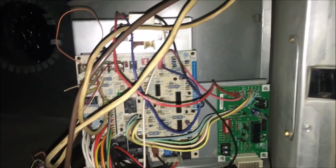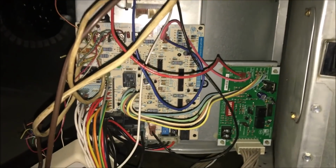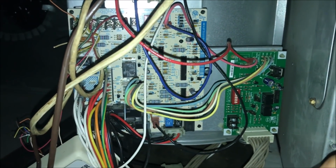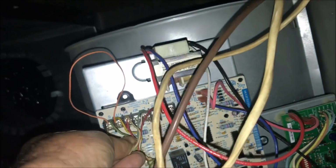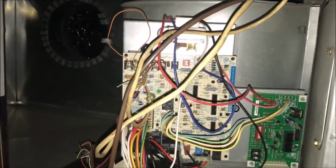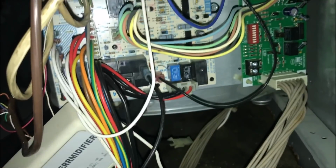But I smell something. As soon as I open this up, I could smell something burnt. I don't know if it's fan motor, transformer, or what it is. We're not getting any power. And the fuse is not blown. Like one screw missing, just those two that hold the blower in. Somebody's definitely been working on it other than us, because this is not ours, but hopefully that's not either. I don't know if somebody's had to replace the motor or what would have happened.